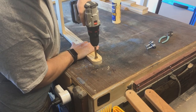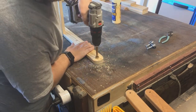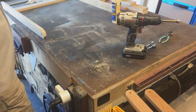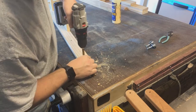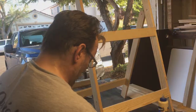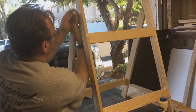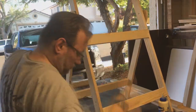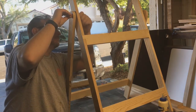This is important: I used a Forstner bit — half inch — to drill out a little bit of the hole through the top in the back. The reason is that when I put the screws in, I want to hide the heads so I can put the piece in and then pop the heads out. Here I'm assembling the base with quarter-inch bolts, washers, and lock nuts.